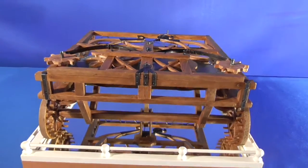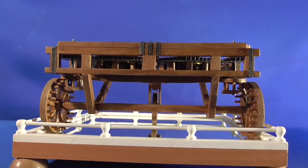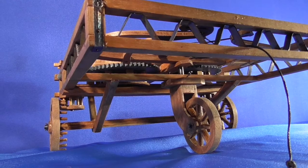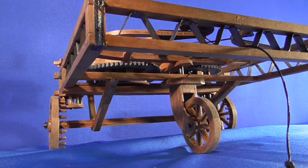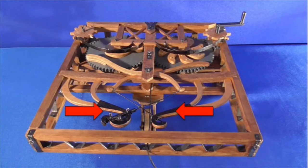At the rear of the chassis there are two arms, from the ends of which two tie rods are launched. These act on two levers which, by pressing against the discs fastened above the main gear wheels, produce a braking effect. The push of these levers is adjusted with a rack.